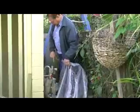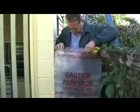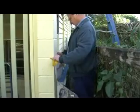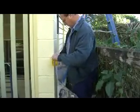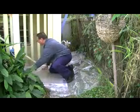Other things to do in advance are to lay plastic on the ground and fix in place to catch any dust or residue that may fall from the work area. Tape an asbestos disposal bag to the wall to act as a convenient waste bin for asbestos containing materials and for later disposal of all PPE. Set up a separate flat area covered with plastic sheeting to be your decontamination area.